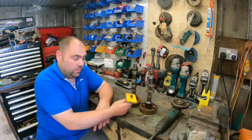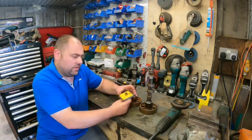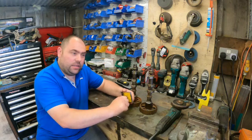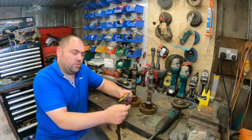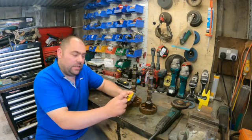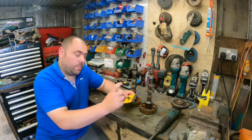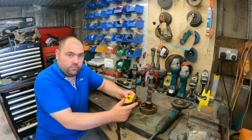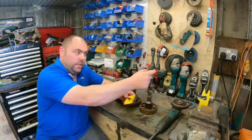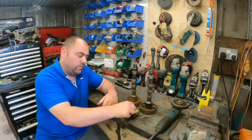What I've done is cut some bits of plate up — I pre-cut this purely because I didn't think you'd want to see it, it's just a boring job cutting stuff. I've cut some plates, I think it's 70 by 70, and put a hole through the centre of them. What we need to do is clamp this in the lathe and then do an interrupted cut to get it round, probably aiming for anything between 50 and 65mm outside diameter, and then once we've done the outside diameter we can get it clamped up in the three-jaw chuck.